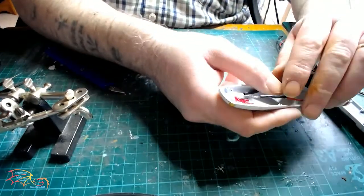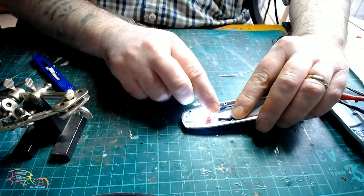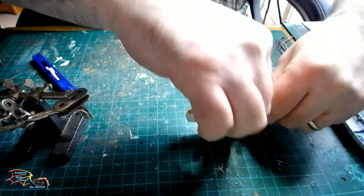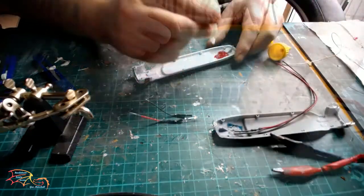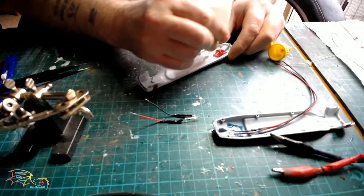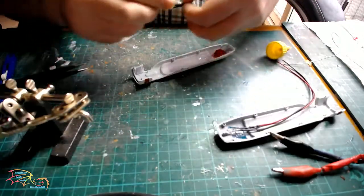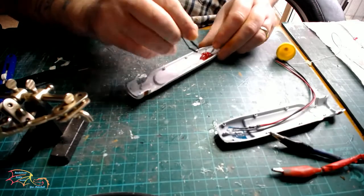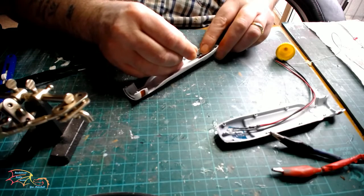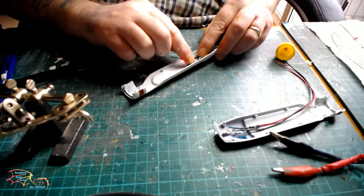This is the light test and you can see where it's going to go — just there — and it's flashing, but when I flip it around you'll see it flashing red. Once that's there I'm adding a little bit of super glue to attach it. Be careful not to put glue on the actual bulb itself, because that will distort the colour and in some cases may actually stop the LED from working. Only put it on the metal or plastic parts.